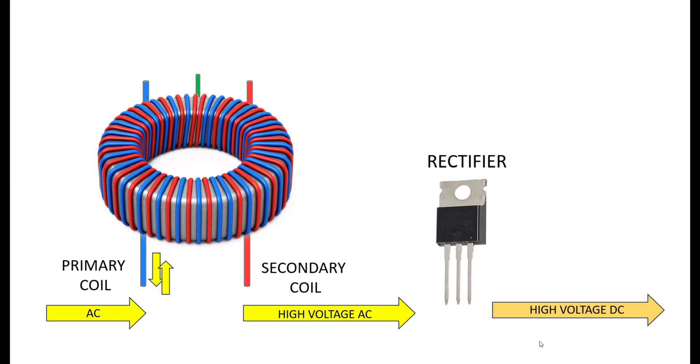Why do we go from 12 volts DC to 60 volts AC and then back to 60 volts DC again? That's because direct current cannot be stepped up. To step up voltage we need it in alternating current. So we convert the power supply from DC to AC to step up the voltage, and then convert it back to DC because the amplifier electronics and voltage rails need a DC supply to work.